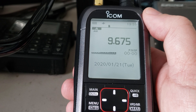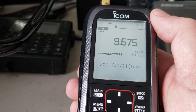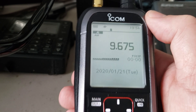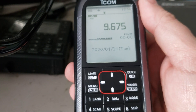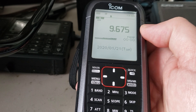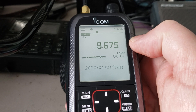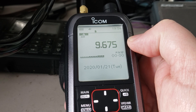How does it perform on longwave, mediumwave and shortwave? There's an internal ferrite antenna that is supposed to do something — it works but not very well, and honestly you'll want to use an outboard antenna to actually tune the bands. I'm plugged in with my W6 LVP magnetic loop for the shortwave bands, and the MLA-30 for mediumwave and longwave. With an outboard antenna, longwave is decent, mediumwave is not bad at all, and shortwave is quite good — even with the telescopic.